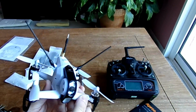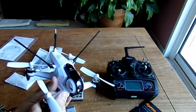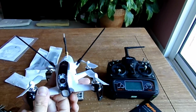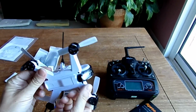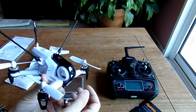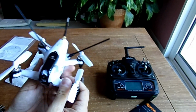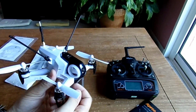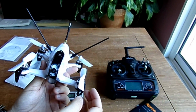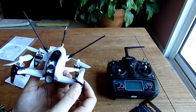The first word I should say about this quadcopter is about the main structure. Compared to the F210, now everything is in plastic, so no more carbon elements. The big open question will be the crash resistance of such a nylon plastic structure. You gain in terms of weight, as it is about 2.5 times lighter than the F210. The energy is proportional to the square of the velocity.